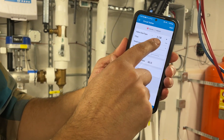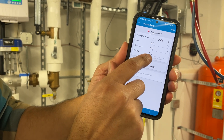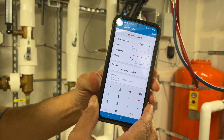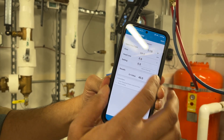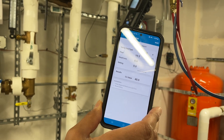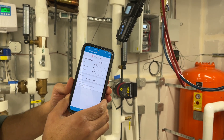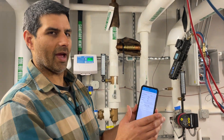The first thing we do is set it to the valve size and the setting — which right now is set to zero — and then we enter the head loss, the pressure that we measure on the valve on the manometer, which is 0.55, and that tells us the flow. Right now, 19 gpm is what it is estimating the flow to be. One challenge with these valves is that if there's very low pressure differential across them, they don't give accurate readings.